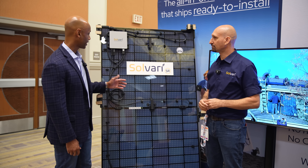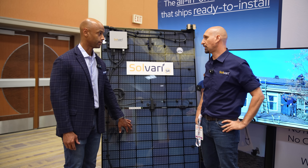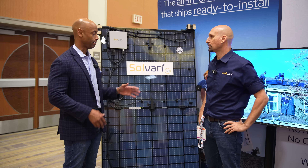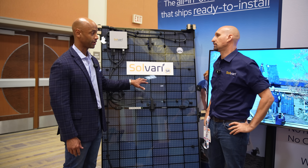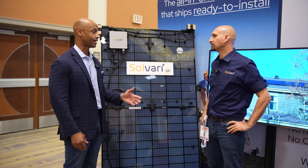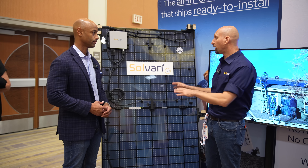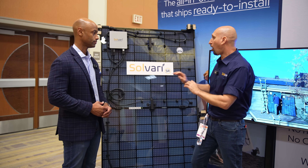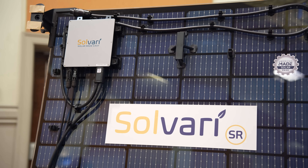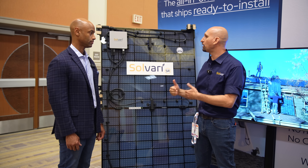So when you look at the solution, you're getting solar panel, inverter, and racking all in one SKU — you wouldn't compare this to just a solar module, you're comparing it to all three products. And since they're integrated in the factory, there's a tremendous labor savings for the installer. We are pre-engineering this, meaning all the connectors are from the same manufacturer, made to work together. We're ensuring the inverter is sized to the panel so you get a really low DC to AC ratio for better performance.